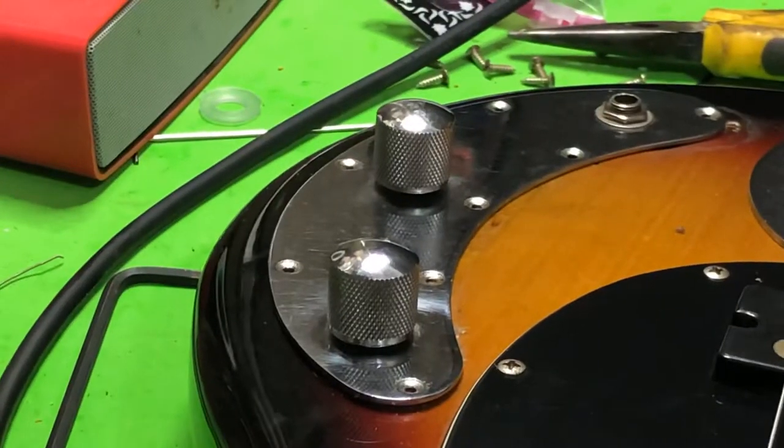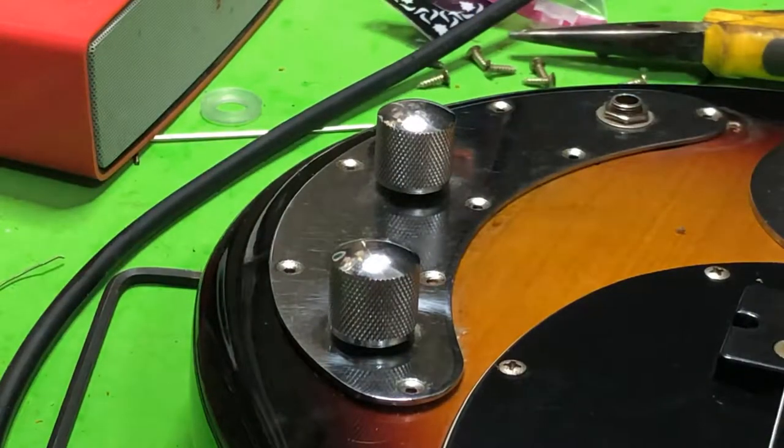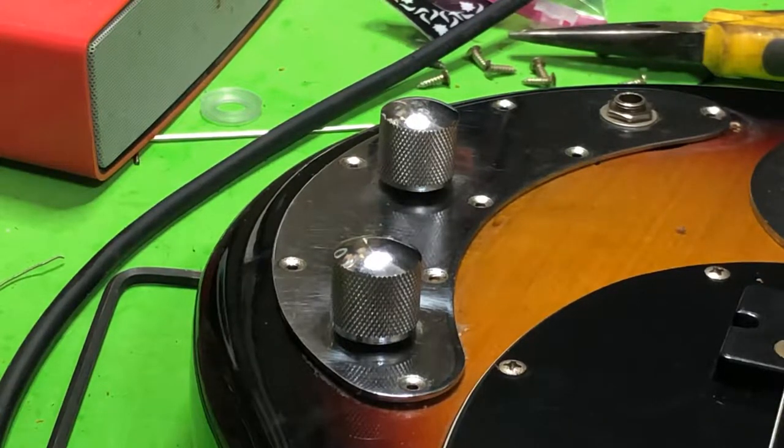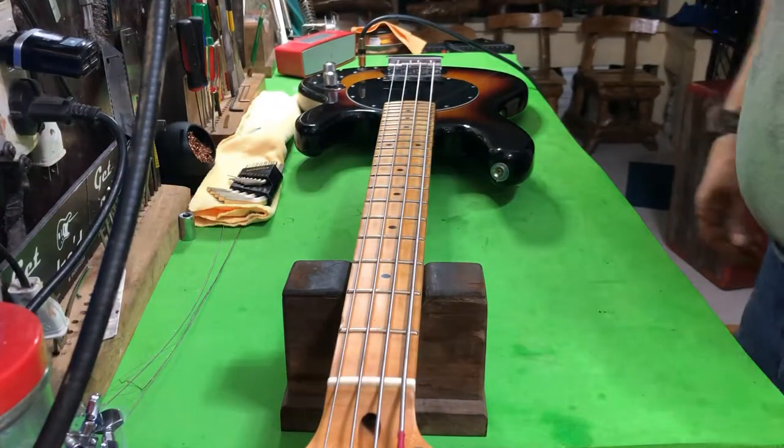I think no. That little wire on that tone pot there, less than a millimeter from the metal plate. I'm sure humidity was playing a factor there, and as he played, it starts to ground. Volume gets lower, then it cuts out, then it comes back. Kind of like static electricity, except with humidity. Okay, hang around.